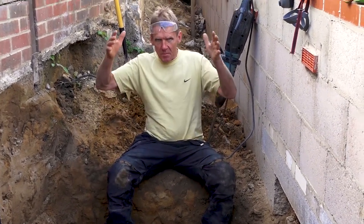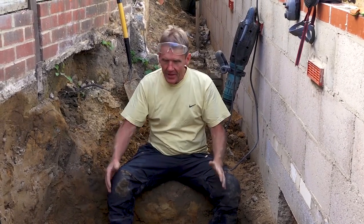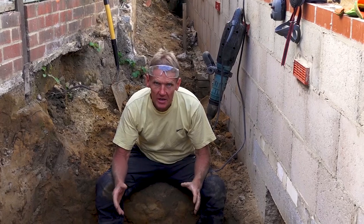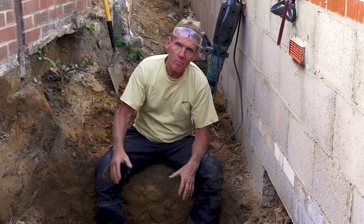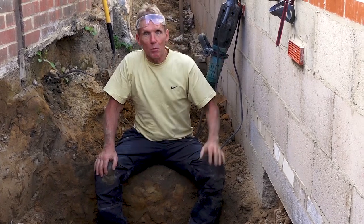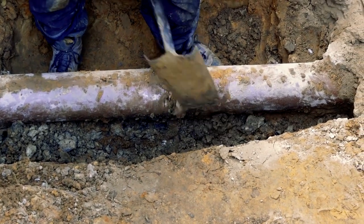The first thing I've got to do is dig under this existing pipe and lay some concrete under it - that's going to be the foundation: 150 millimetres of concrete under that pipe, which will be the foundation for the new manhole. It has got to be built of brick. In this day and age you might think you'd use plastic, but Thames Water insists it's done in brick and that all this is replaced in old-fashioned clay, so it'll be a good job but it'll take a bit of doing.